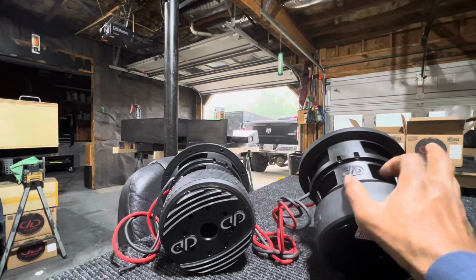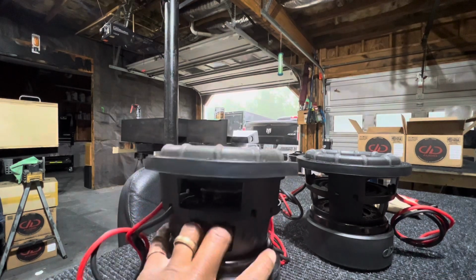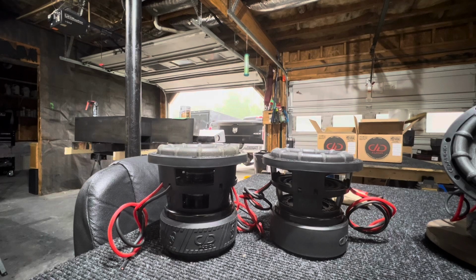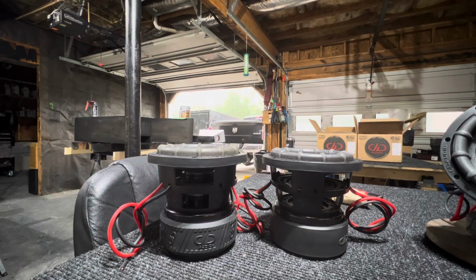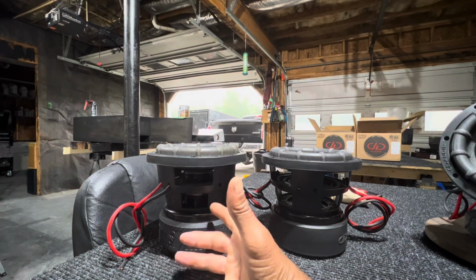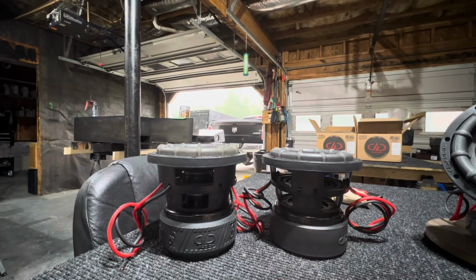Now, of course, I recommend with any hand-built driver, if you're going to pay the price to get a hand-built driver, you might as well make it supercharged. So these are two supercharged drivers, and as you can see, the 1506A has considerably more girth, larger magnetic slugs, just slightly, I think maybe an eighth of an inch. The bottom plate is different. Plus, that coupled with the heat sink gives it more mass. That added mass is going to let the heat generated inside the coil dissipate far faster than it will in the 1506. So once again, he has improved the performance.